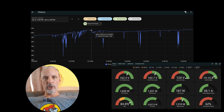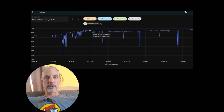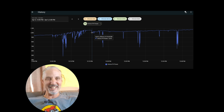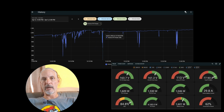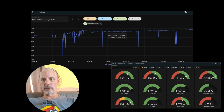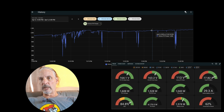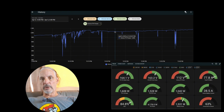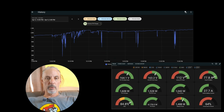So there would have been a small slope incline here because we're coming up on solar day, but in a period of 15 minutes, not even 15 minutes, 10 minutes, it would not have been 100 watts. So it does look like it was close to an estimate, 8 to 10% increase, and that is totally a guess. Now that's peak, and you can see here that after I finish, and this is probably me splashing the back right here, or splashing those top ones. You never know also with the Victron equipment, sometimes it does a bounce thing, and you can easily see the ups and downs. It doesn't look like it's recorded a whole lot of those this time, which is nice. But even here, we're at 1,030, 1,040, and it's still on its way up for the day. So I would say that the 1,028 to this 957 is probably more accurate of what the change was.